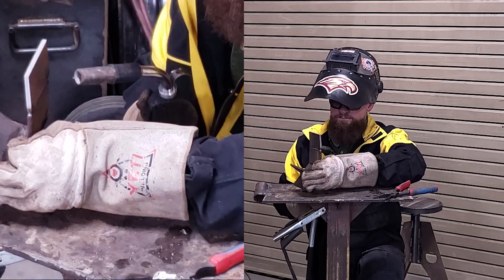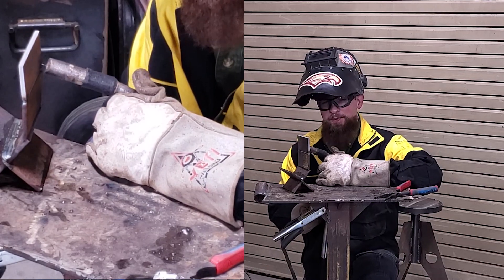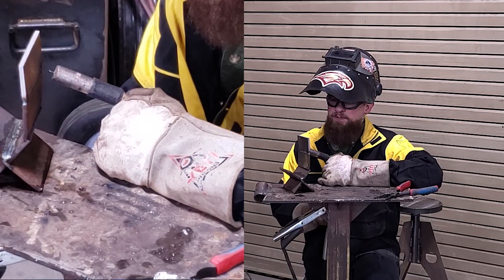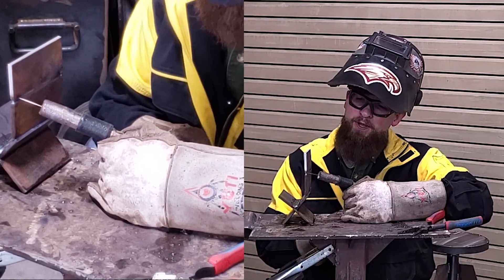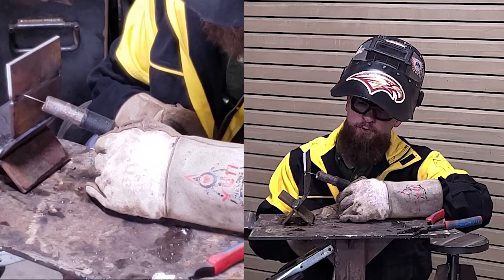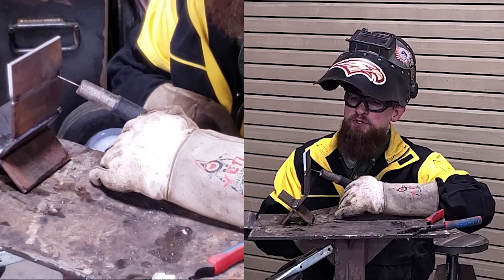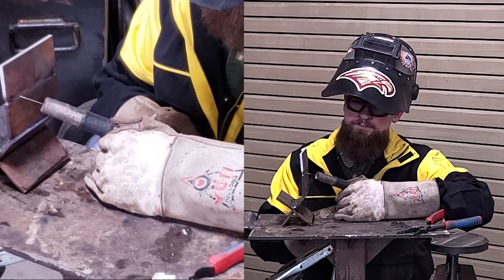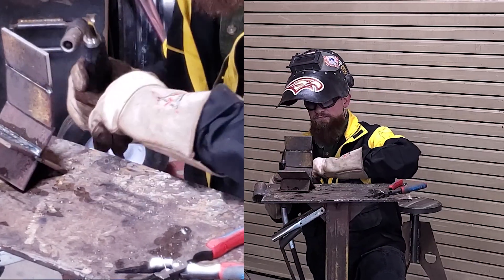As I lean down and get as comfortable as possible, my gun angle — I still want to push. I want to be slightly favoring up on the top piece because gravity is going to pull that puddle down to the bottom piece. My method for this weld: I position just above the bottom edge. I envision my wire barely going past this bottom edge and shooting towards the back top edge — that's the gun angle I want, while also pushing slightly. I'll start on my tack; my wire stick-out is long just to show you, but I'm slightly up, slightly pointing toward that back top edge, and I'll push it all the way down, staying in front of the puddle.